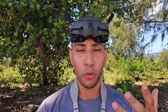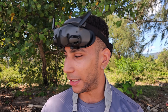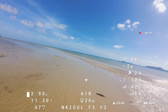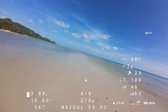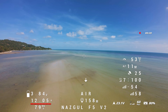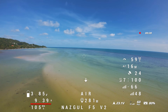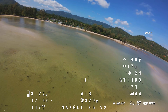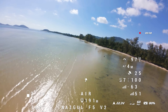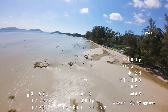Now I've got the lithium-ion pack on. My low voltage alarm in Betaflight is set to 3.5V so it'll be shouting low voltage for a lot of the time, but I know I'm flying a lithium-ion pack so I'll monitor the cell voltage myself. Taking off with the lithium-ion now — at the same 50 km/h cruise we're pulling 12 amps, versus 9–10 before, so the extra weight gives a slightly higher amp draw. But we're still miles below that 35A constant current threshold.